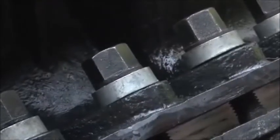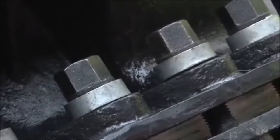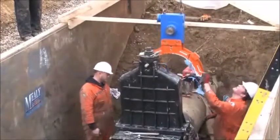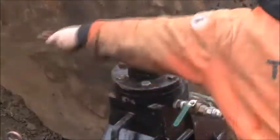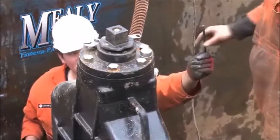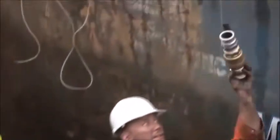An exclusive feature of the EZ II valve system is that the bolts have sacrificial anodes attached to them. This value-added cathodic protection increases the valve's longevity. The drive ring is removed. The stainless steel restraint bolts are installed and tightened, assuring that the valve stays in place. The resilient wedge gate is expanded into the ID of the pipe with 100% seal attained. The valve bonnet blow-off valve is removed and a pipe plug is inserted, while the chip flush fitting and valve are also removed. This installation is complete — what's left behind is a valve ready for years of use.